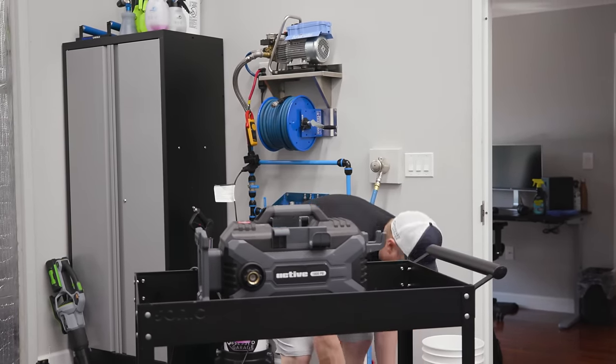One of the things we're already working on is getting rid of this plastic connection where the inlet comes in. That was 10 minutes just for me to get to the inlet connection here. Tommy and Jeff said they wanted me to tell all about this thing. So this you're going to torque down as well. There's an O-ring inside of there. Make sure there's a black O-ring. And you can do that by hand. Again, if you start getting out pliers, channel locks, you're probably going to run into issues.